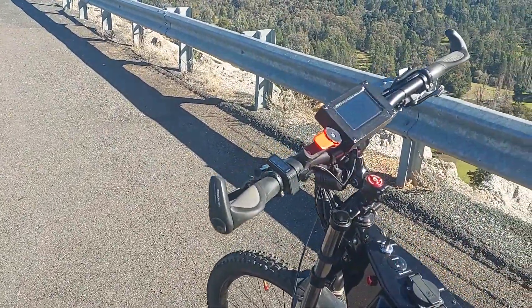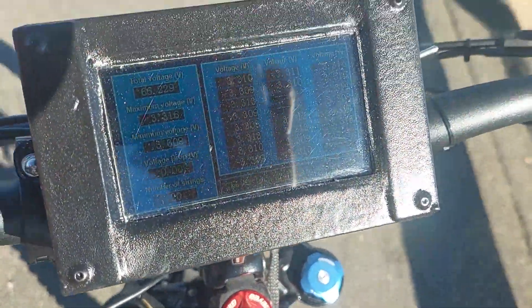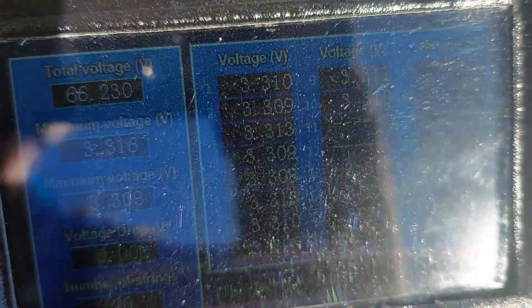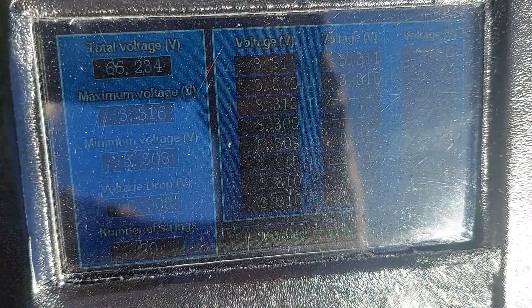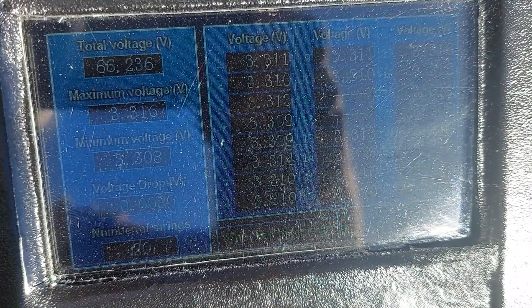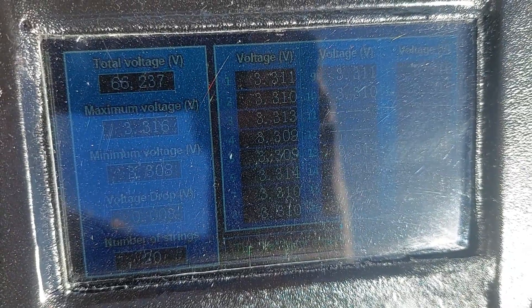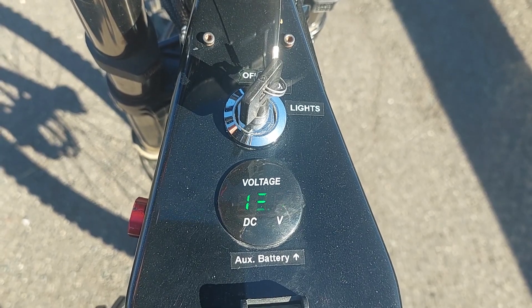There's very little resistance. I made a screen up that gives me the total voltage and my cell voltage on every single cell, and that's hardwired to the battery via a 66 amp fuse and every single balance lead, so it's pretty safe. There's also an additional voltmeter — that's the auxiliary battery voltage — which I didn't have previously.